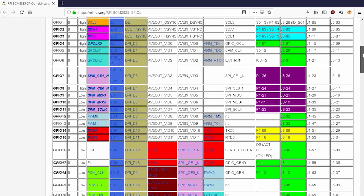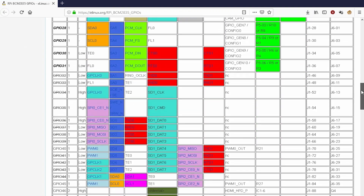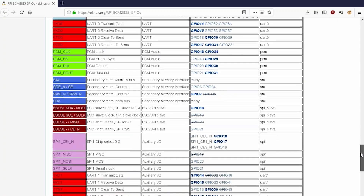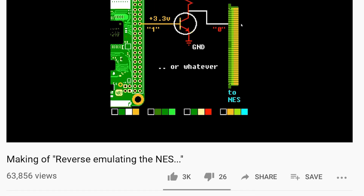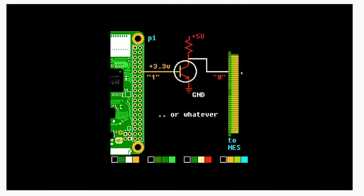The Raspberry Pi has a number of parallel interfaces that could perhaps be used to eliminate the FX2LP, but they're very poorly documented and would require so much external glue logic and voltage level translators that it would probably use more hardware in the long run anyway. I believe this is the approach taken by Tom Seven in his excellent video series reverse-emulating the NES — I highly recommend watching them, as they cover many of the same concepts in far greater detail.